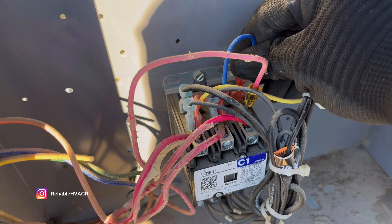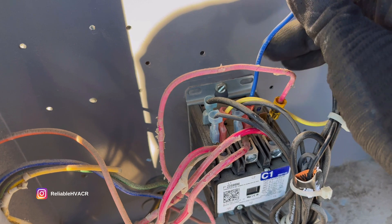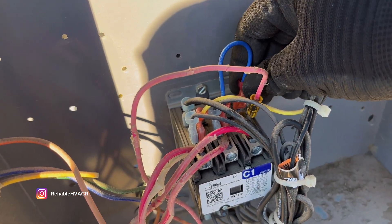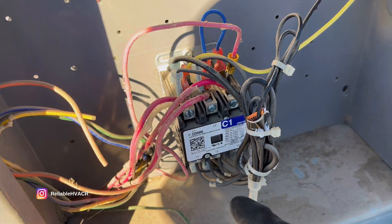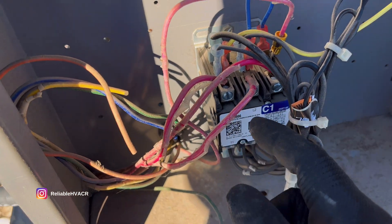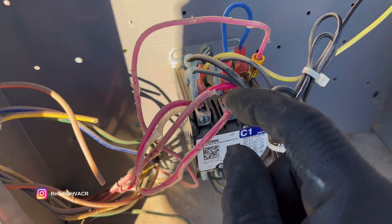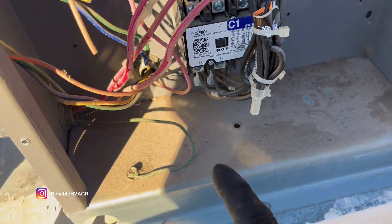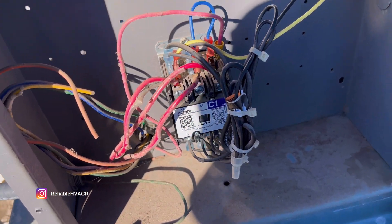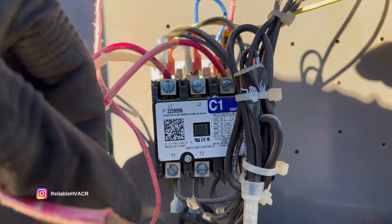If this one's insulated you can't do too much with it, but if you had a jumper you could hook up here. Since this one is the one feeding the coil, this is my line voltage — I'm just going to unscrew this, take it out, hook that up to my line, and then ground out the other ones. That'll give me the 115 volts. I unscrewed it and took it out because that's the one jumping to the coil, so the coil will not be engaged.